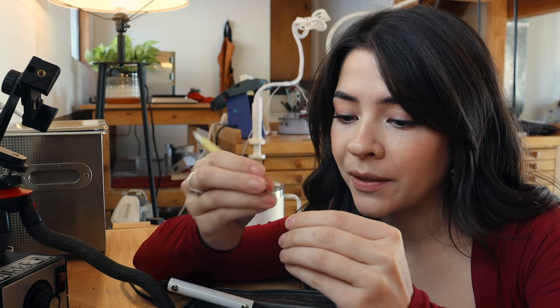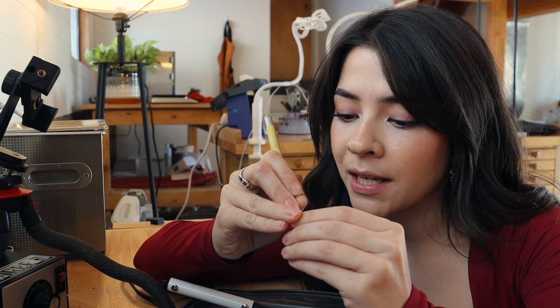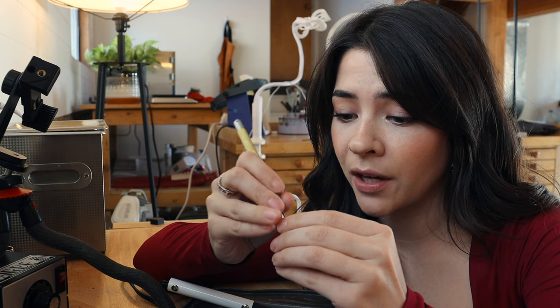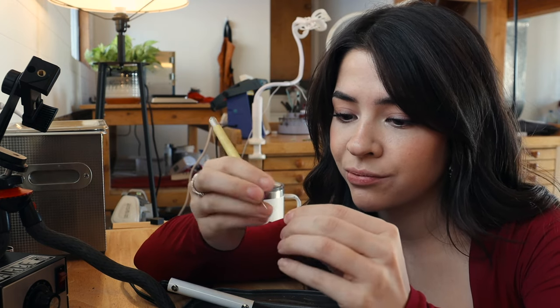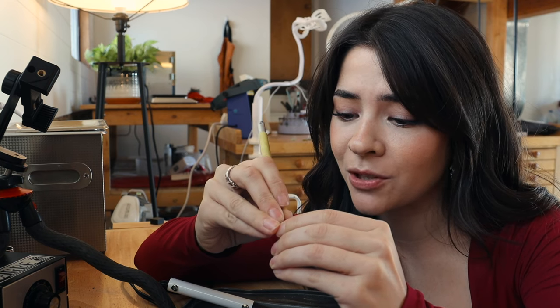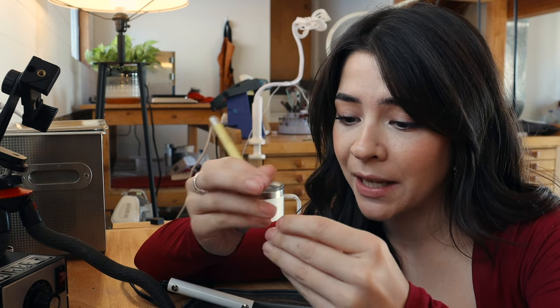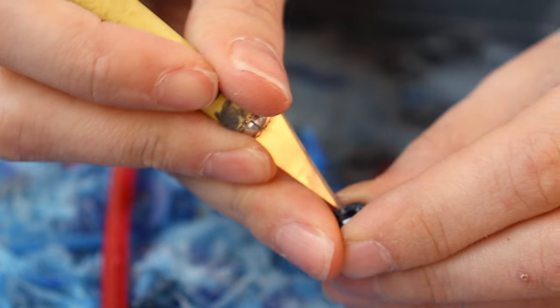And then I'm gonna build up my bezel in height. And that way when I cast, I just put my stone in and I push my metal down over and it just makes it so much faster. I wasted a lot of time and a lot of materials in the beginning trying to, I guess, be lazy, although I didn't know I was being lazy in the moment. I was just trying to make a decorative choice, but it just ended up wasting a lot of my time. So take the time to carve it away and then build it back up.